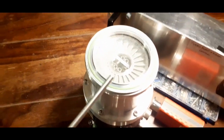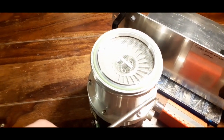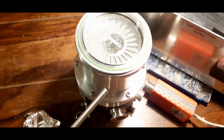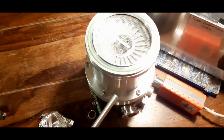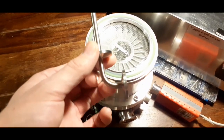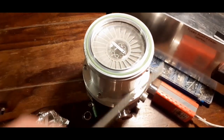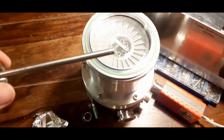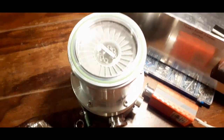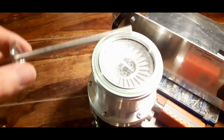Now, ideally for this setup, I would have a large-ish vacuum chamber on top of this with a lot of ports and maybe a sapphire viewport and a residual gas analyzer, but that is tremendously expensive. I think phase 1 vacuum chamber is going to be a large KF50, 50mm internal diameter, with these flanges cross or a 6-way fitting. That'll give me a lot of ports and pretty large volume to do stuff in. I'm going to mount all my experimental setups on narrow aluminum sleds that'll just slide into the vacuum tube, and everything will be solidly located within the experimental setup, and then I can make whatever I want of feed-throughs.